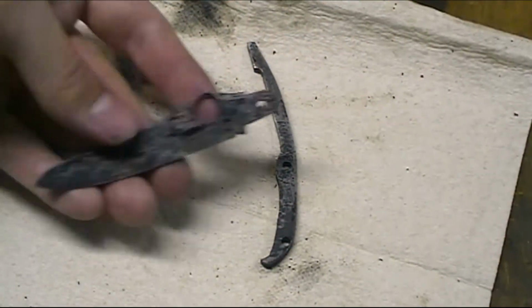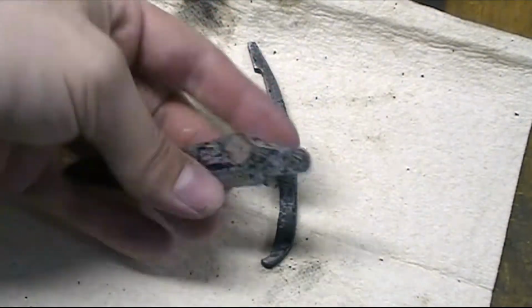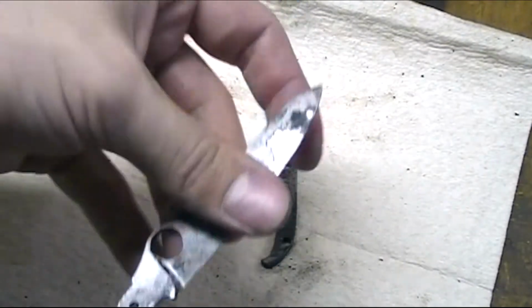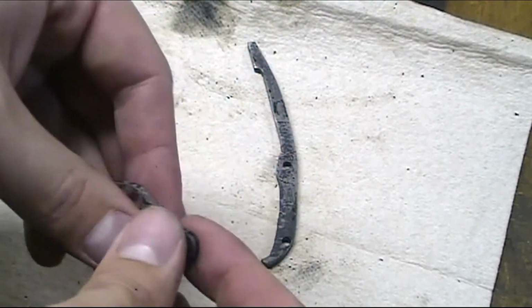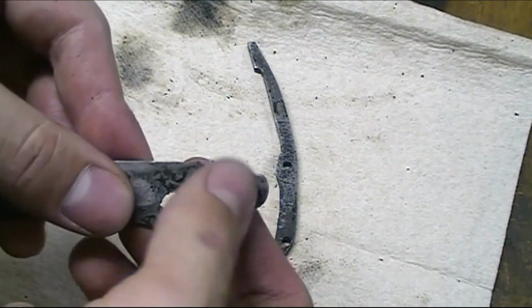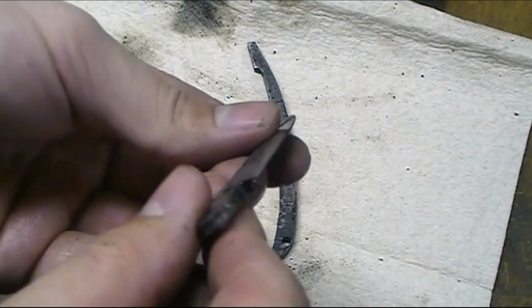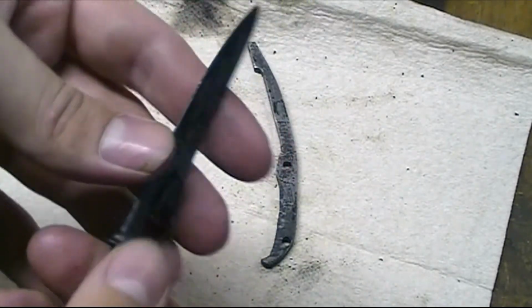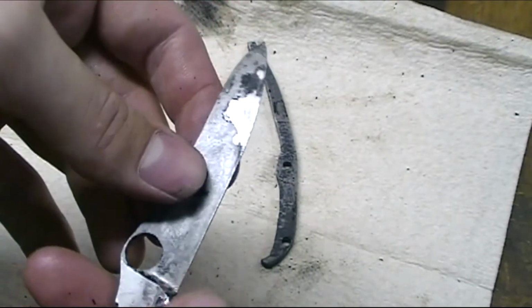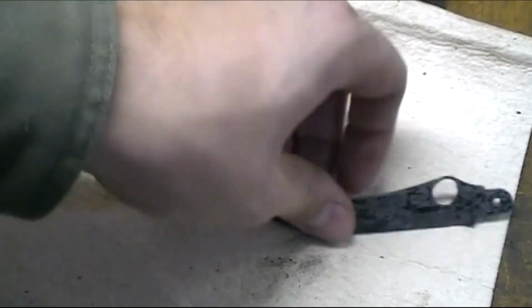So, just heat treated them. That's what they come out like. You saw I did a double quench on this guy. And A, that refines your grain structure a little bit, but the main issue is this back part of the pivot didn't get hardened the first time. So I just had to do a second quench, which, I mean, doesn't hurt it any. These weren't forged. They were made from stock removal, so normalization and some other stuff wasn't as big of a deal, since they already came annealed and normalized.